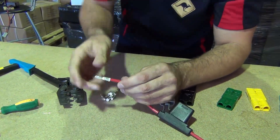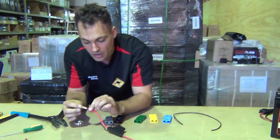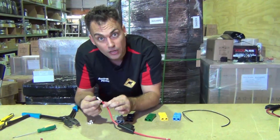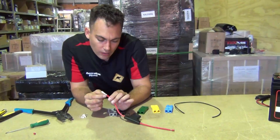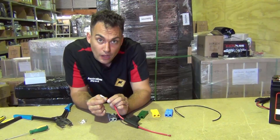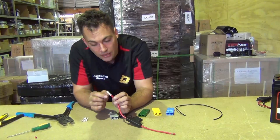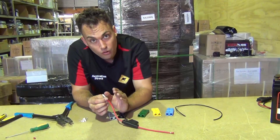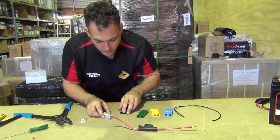We've stripped the end of the cable and we're going to put it inside the Anderson plug terminal. You can see with this heavy-duty set of crimpers how easy it is — boom, that terminal is now crimped on. It's always worth giving it a good pull to make sure it's on there firmly; sometimes you can put a couple of crimps in to really lock it in place. One mistake people make is flattening the terminal with pliers — if you flatten it, it won't fit inside the plastic housing properly.